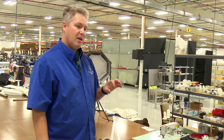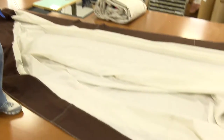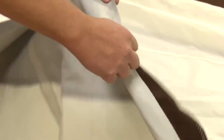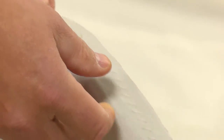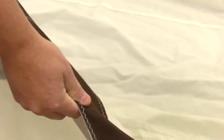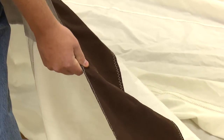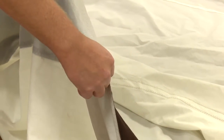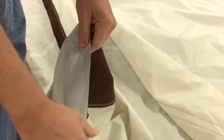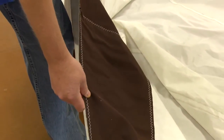One, the cover's on wrong. This was done before Jim had the boat. This is just a cut edge — no tape, no leech line — and of course that's causing some of the problems of the older sail. Without any reinforcement and no leech line, there's no way to control the leech flutter. Jim said there was excessive leech flutter on the sail.